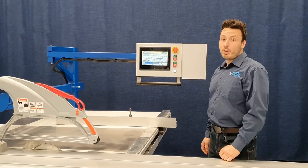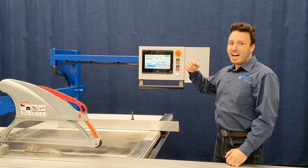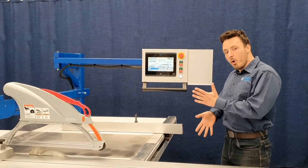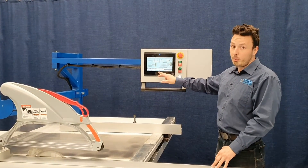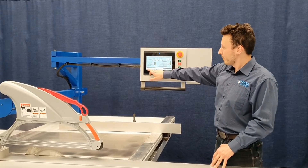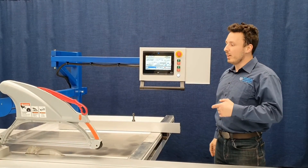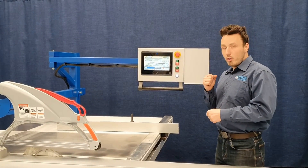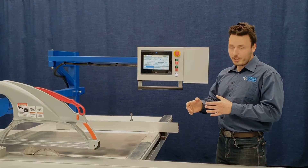Setting up the panel saw is pretty straightforward. Hit the start button, proceed, start in delta — ready to start the scriber. The scriber will move up automatically, and you're going to cut through, which I'll show you in a moment. Hit the stop: the machine will stop within less than eight seconds, which is required by law. It's not a normal brake — it's an electric brake, so there are no extras attached to the motor and it lasts longer.